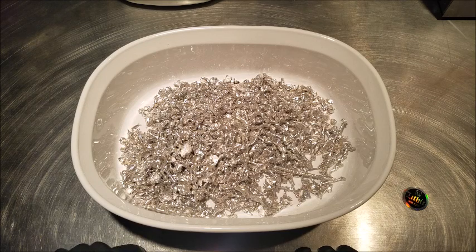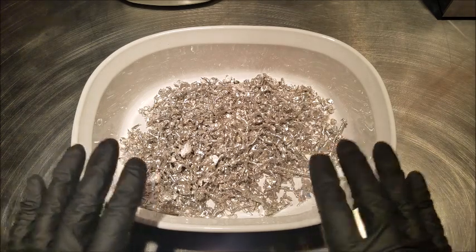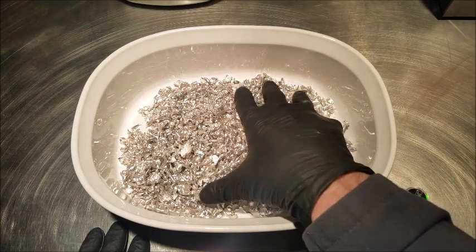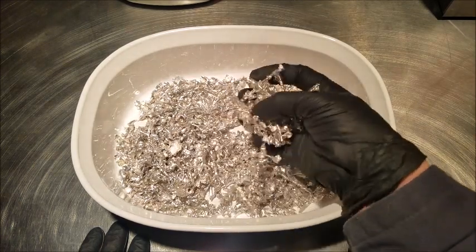You know, in the previous video, I believe I said the solution becomes exhausted, the electrolyte, when it ends up with approximately 80 grams of copper in solution. I'm wrong. That was me just talking to myself practically. The real answer is 50 grams. When it gets close to 50 grams per liter of copper in your solution, that's when you're going to start to plate out copper over your silver. That would not be pretty.